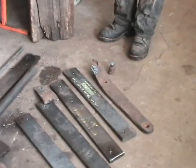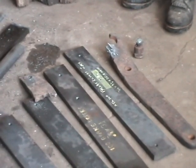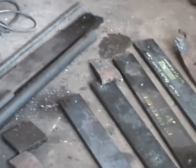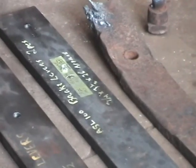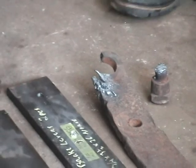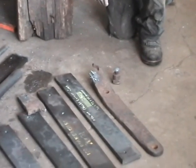They pull the brake shoes, which are cast iron pieces, against the wheels to stop. Well, at some point during its life, I don't think it was at Sanford, the air compressor, which controls the amount of air that's pressured in the air cylinders, didn't stop when it reached the height of the pressure that it was supposed to get, and they overpressured and broke where you can see the ends of the beams.